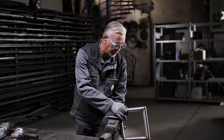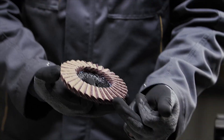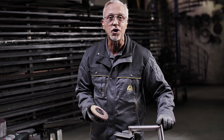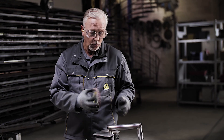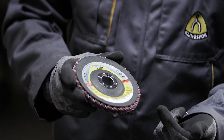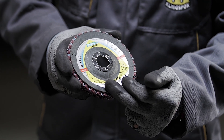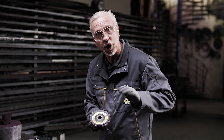The first product I'm going to use is an interleaved flap disc. The flap disc is made of nylon web and also coated material, and what's impressive about this is it can take the metal away but also blend at the same time. When working on tube, the grained area goes around the outside of the tube, and working with a rotating tool like this around the edge, we also maintain the scratch pattern. An important thing to notice on the flap discs is that we have a maximum speed, but we also have an optimum speed. The optimum speed will give the best life for the product and also enable better finishing with lower heat.